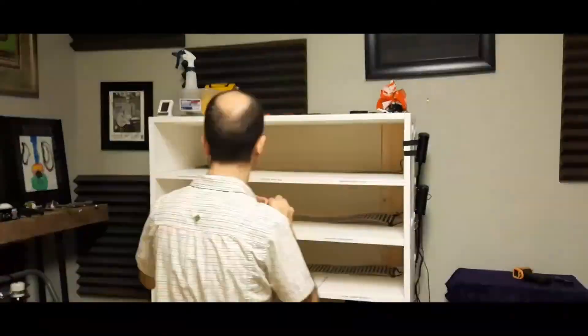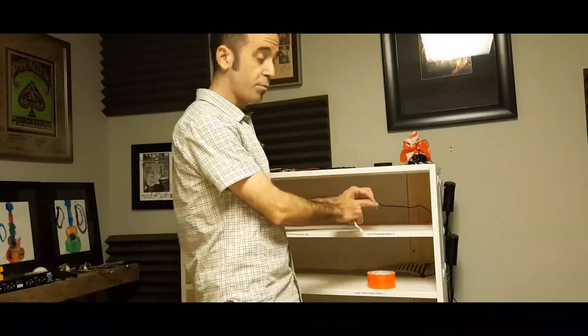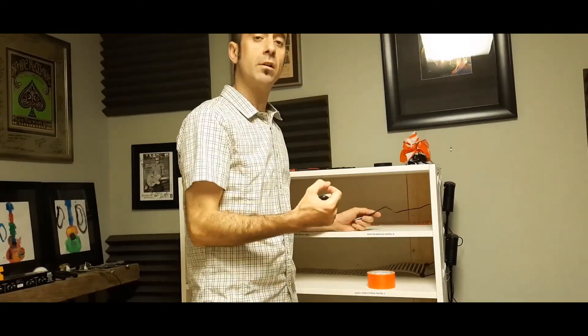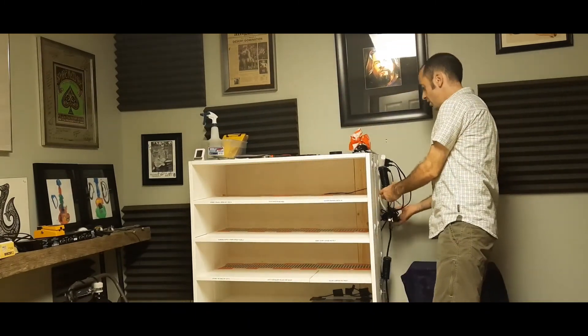Time to install the heaters and install the probe. Make sure the probe gets placed on one of those black heat elements — you don't want the probe on the clear plastic part, you want it where the heat is. We've got it all wired up — it's nice and tidy inside: one long strip per shelf, one consolidated thermostat. I freed up the other resources, which is going to make for a better rack with less maintenance. Now I've got extra thermostats and heat pads I can sell, build other racks, whatever. Thank you for joining me today — if you want to see more videos on our journey from family hobby to family business, like and subscribe. Cheers to you wherever you are, I'll see you next time.